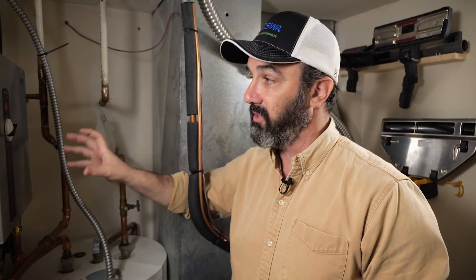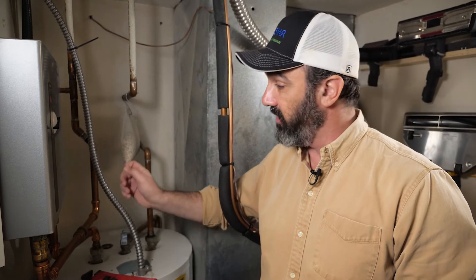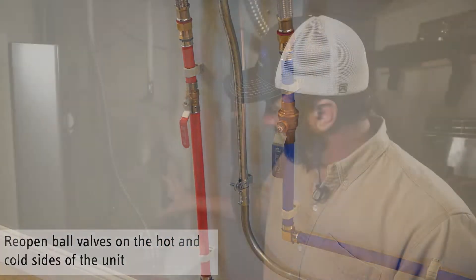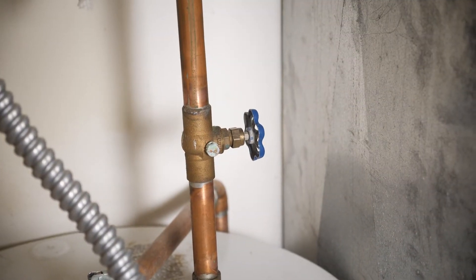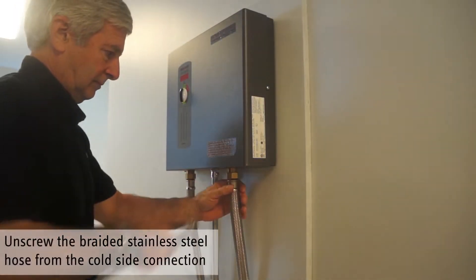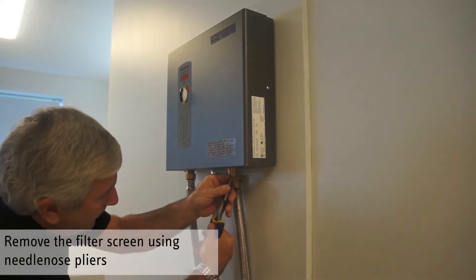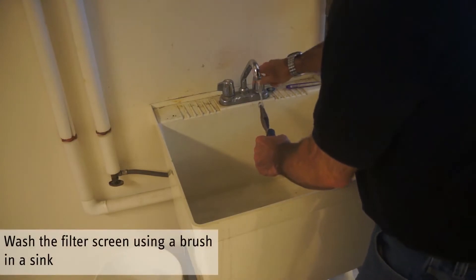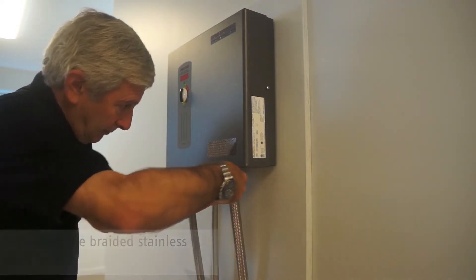The next thing you're gonna do is stop the flow of water going into the tankless or instant hot water heater. Now this configuration is a little bit unique. Normally you would have a valve that you can shut off going directly into the tankless water heater, but in this case we're gonna shut off the water at the main valve. Then you're simply gonna take a pipe wrench and unscrew this intake valve right here. Once you do that, there is a small screen — just like your kitchen sink — simply remove the screen, typically with a pair of needle nose pliers, tap out the dirt that's in it, and then do it in reverse: reconnect it, tighten it, and you're good to go.